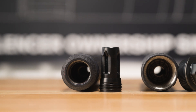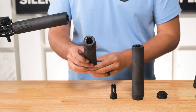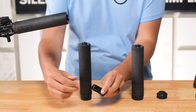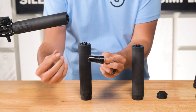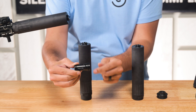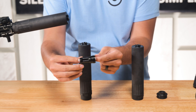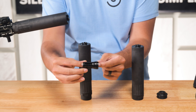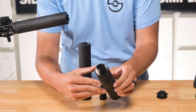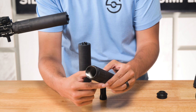Just like those rifle cans, the MOB is available in two different mounting options: the inbuilt QD TSFX Spooky mount, which includes the Spooky 1 flash hider in half-by-28 — a flash hider that uses a mounting taper followed by 16-by-1 left-handed coarse threads to keep the silencer aligned and on even at the highest rates of fire — or the universal hub mount in 1.375-by-24.